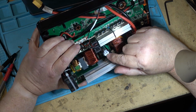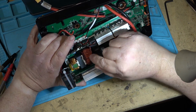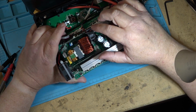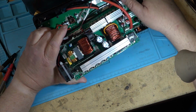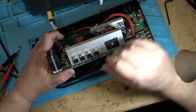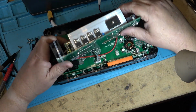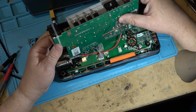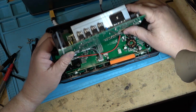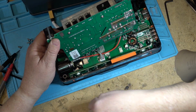This then is presented over to the pure sine wave inverter, which is this transformer and this, two transformers here, capacitor and your control circuit, to generate the sine wave signal, and that would be generated with these transistors over here. These will generate your sine wave signal and present that to the AC output terminal over here. This is the terminal there, comes off of this coil, goes through this conductor, and that is the AC inverter.